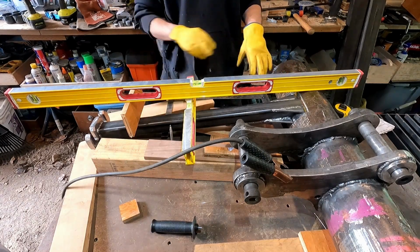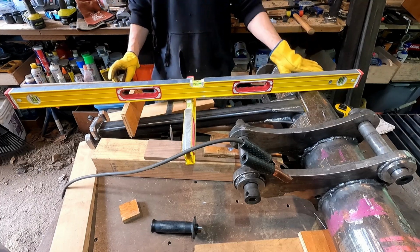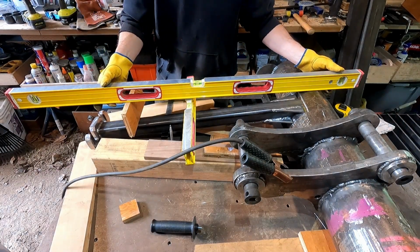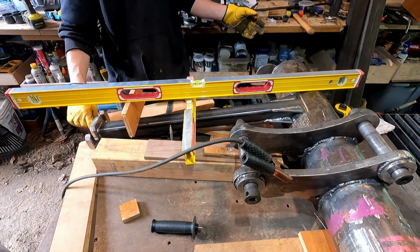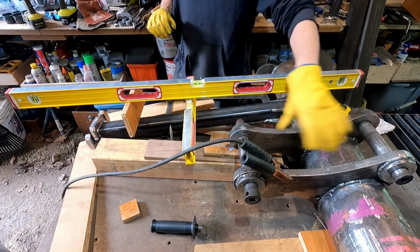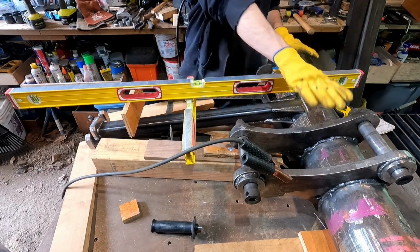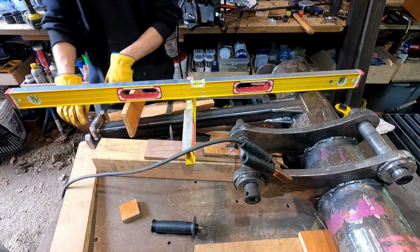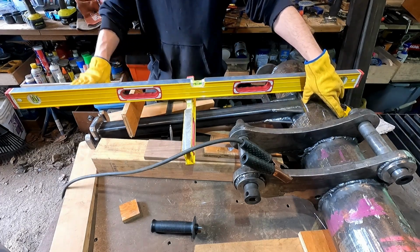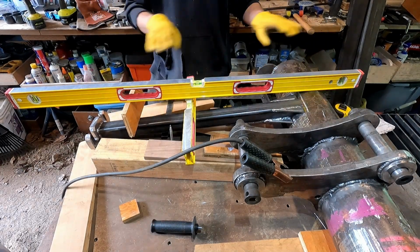And then I picked a point out here 2 feet back and measured, and that needs to be 3.936 down from the top of this tube. So I cut this piece of wood to that dimension, marked, rested it there, and set a level across. And of course that was too low, so then had to space everything else up a little bit to get it to fit. But I've got the same initial alignment I had before, where these are 2 inches different, and it's level across, and I've got wooden wedges and spacers set to hold this in orientation. And then I have 2 wooden wedges here so that I can set this on my scribes there and then raise this tail end here and rotate it to get this level that way